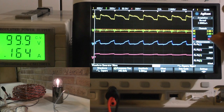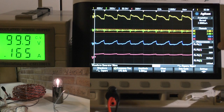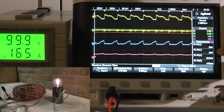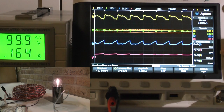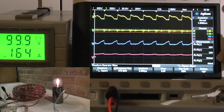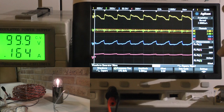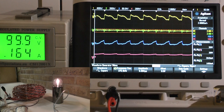300. Look at that. There is no voltage at all anymore. It becomes a voltage divider. It means it's a third of the voltage we have here on the input side. Well, that is interesting, but it's also not reflected in the current. The current is also very, very low. So I have at the moment in the coil far less power, which is required to illuminate this bulb to that level. It's a similar effect to what I saw with my previous coil that I showed.